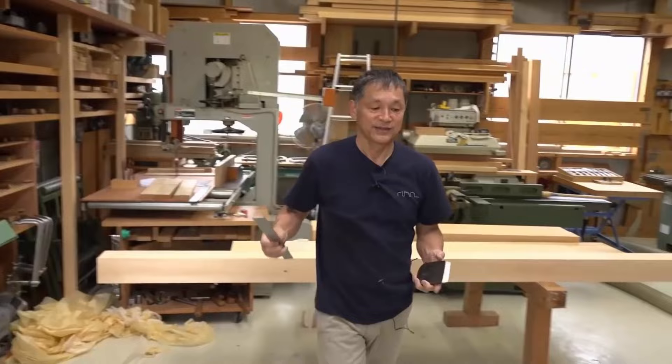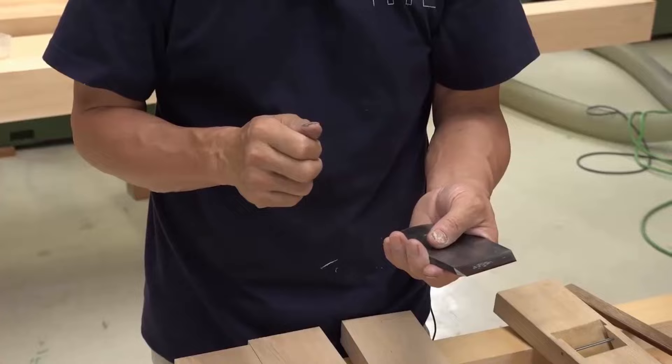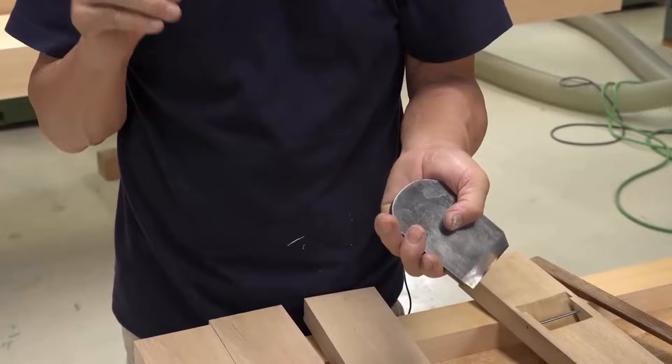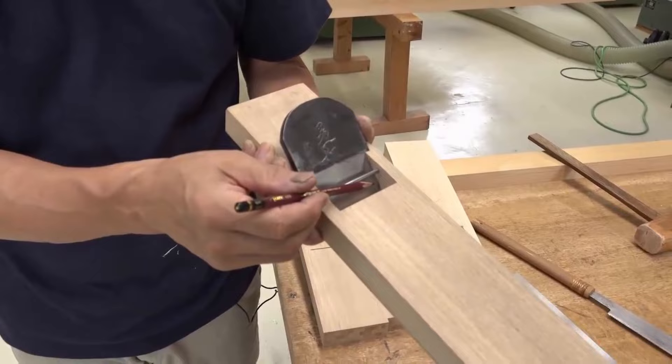If you apply a ruler against this surface, you can tell it isn't flat — it's slightly rippled. If it's severely uneven, I sand it flat. Whether the blade tip will protrude 3 microns when struck, won't protrude at all, or will only protrude when struck very hard — or whether you're trying to make it recede and it unintentionally recedes very far — all depends on how the blade connects with the bed and the blade slot. I only carve the plane's bed once I've checked there's no gap here, no matter how you look at it.